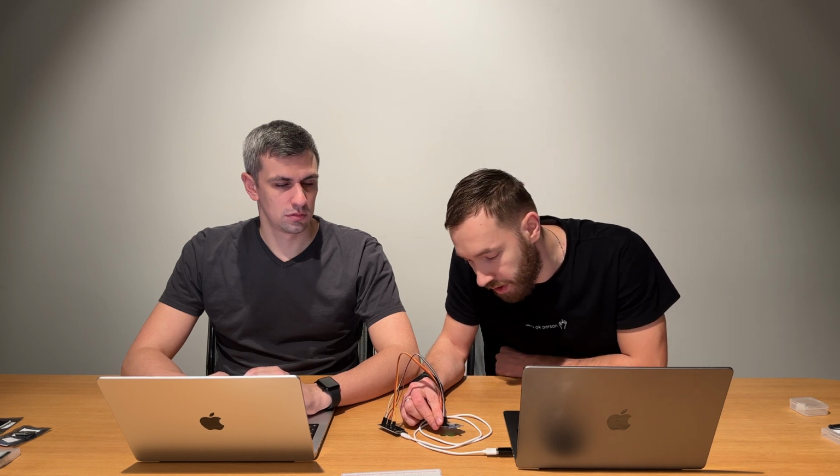So now I will show how to find a correct software library for your screen, which you ordered from AliExpress. This is usually usable for all types of components, but I will show it in the case of our display. So you have to search. In some cases, which is very convenient on AliExpress, you can find some library or documentation in the description of the product. If it's not available, you have to search for some identifier of your product. So in our case, the identifier of our screen is GC9A01.